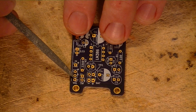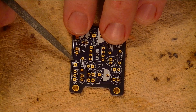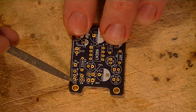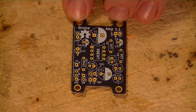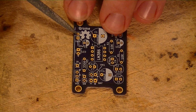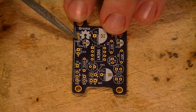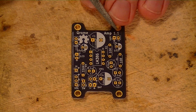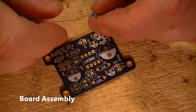These three pins right here are for the volume potentiometer, and this is your audio in. This would be your potentiometer first pin, the center pin here is your potentiometer out pin, and this of course is ground. Up here is the gain potentiometer — the main in pin for the potentiometer, and this is going out. So this is your first pin, this one's going out. This is the speaker — this is your positive and your negative.